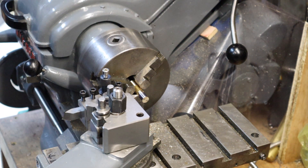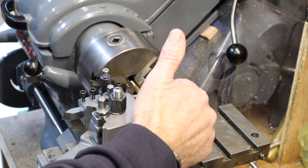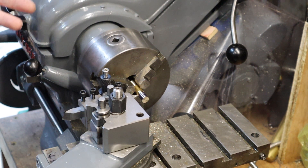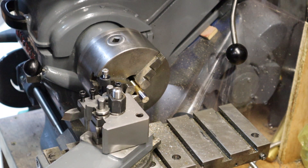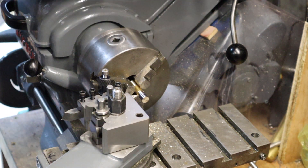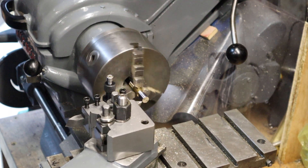Disengage the motor — don't try and do it by using the tumbler gears to reverse it, because although the tumbler gears and everything are all the same ratio, you might engage on a different position on the cog on the spindle and that's going to mess your ratio up. So once you've got all of that set you've got to leave it there. For a small thread like this I normally do it on the handle with the motor off, but for this demonstration I'm going to do it on the motor and hope I don't crash into the chuck. Let's back it out and put it in reverse.